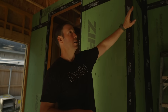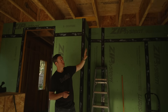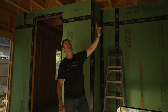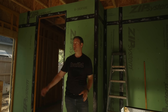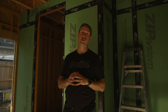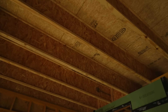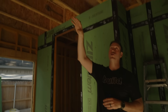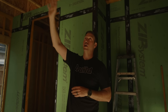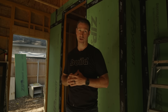Lastly, when it comes time to insulate this space, I'm also probably going to use a little bit of closed-cell foam on the bottom of the second floor. Anytime you have rooms over top of the garage it's really hard to use traditional insulation and get a really good insulation job, so by spray foaming the underside of my AdvanTech subfloor upstairs — that's my second-floor deck — I'll get really good insulation and also a really good air seal.